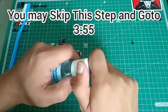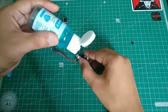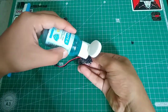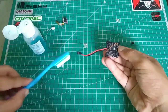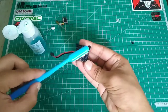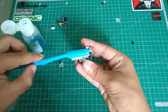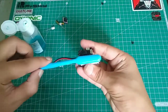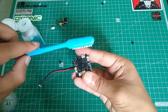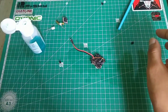The next step is to take some isopropyl alcohol — take a good quantity and spray it all over the board, same way on the other side. Then take a brush, dip it in isopropyl, and gently clean the board. Don't use a lot of force. Go over all sides — the more isopropyl you use, the cleaner it will be.